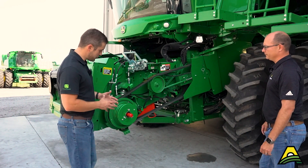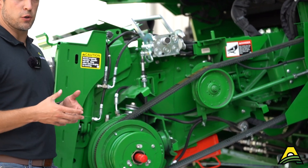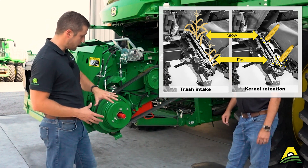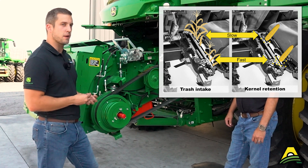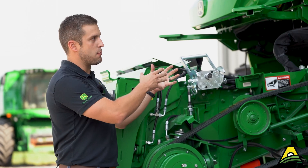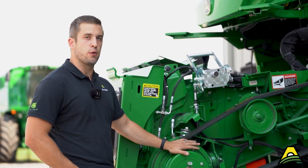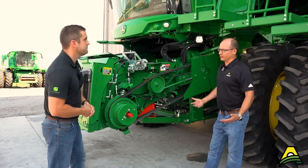Operationally speaking, especially with the corn head, this adjustment can really come in handy. It determines the speed of your row units - how fast it's pulling that stalk down, and if you're chopping, how fast that chopping blade is spinning. There's always a trade-off: the slower we run this, the less ear bounce, the less butt shelling, and the more kernel retention we're going to see in the combine. The trade-off is we may bring in a little bit more trash because that stalk is able to get higher up into the row unit. Early in the season you can probably get away with higher speeds, but as the season goes on and that corn really dries down, it's a good idea to slow this down to keep those kernels retained.